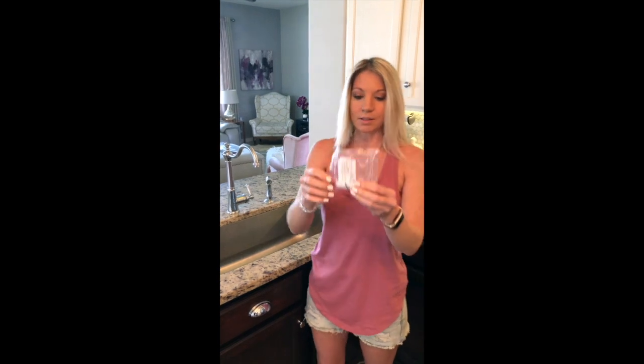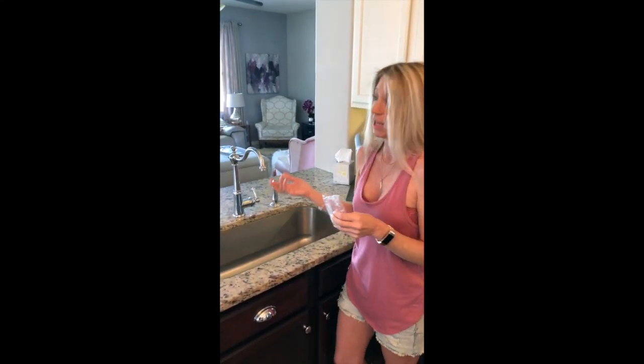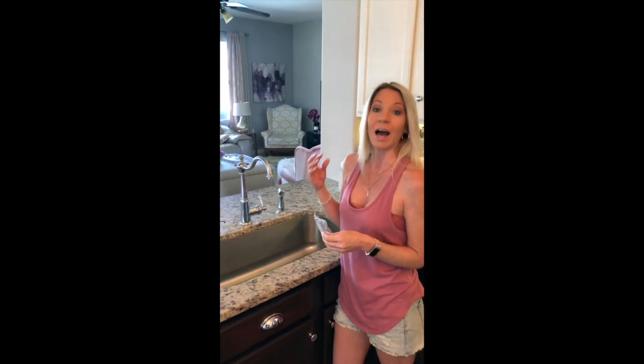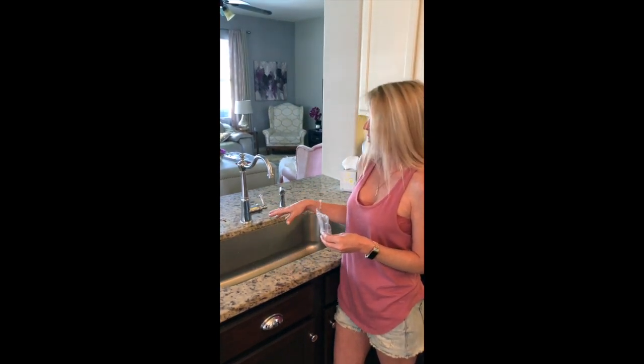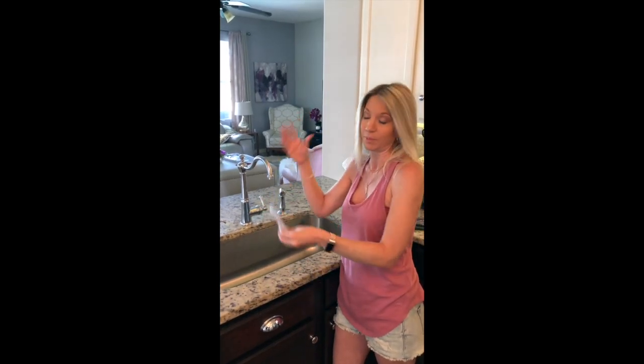So every year or so, we have to replace a diverter, and the diverter is a small part — it looks like this. You can order it from the website where the faucet comes from. In this case, we ordered it from premierfaucets.com. It only costs about $3. You'll know you need to replace this part when the sink starts acting funny, making some funny noises — for us it's either a high-pitched sound, or a high-pitched sound accompanied by rattling and shaking of the entire sink apparatus. It sounds like it's going to take off into outer space.